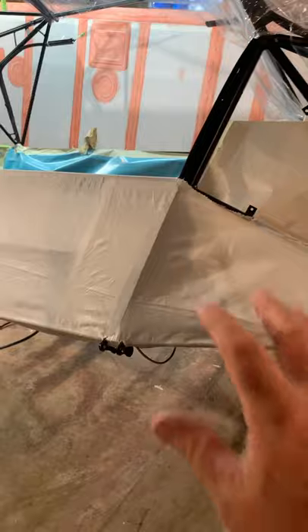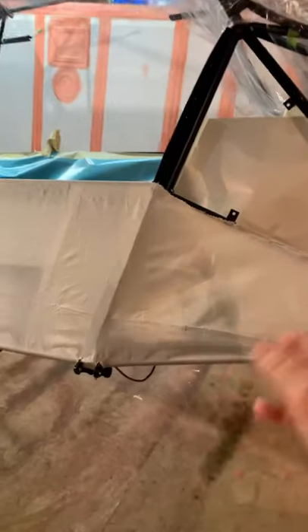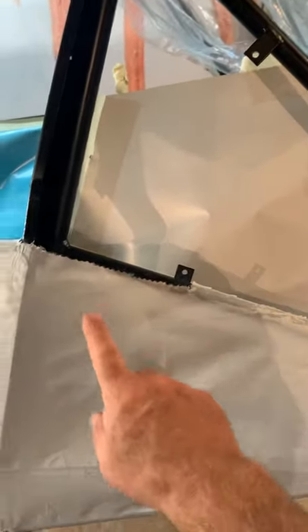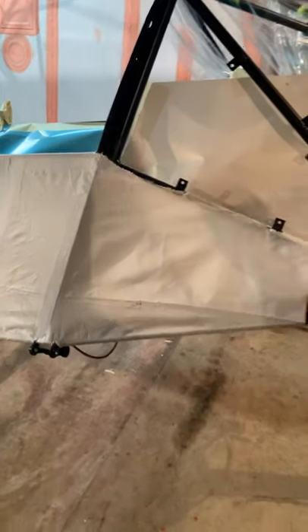A note: poly brush is also a type of glue. After you poly brush — putting the tapes and everything on — it goes down and grabs the poly tack, grabbing hold of all these metal areas it touches. So this is a temporary area. After the airplane is completely poly brushed, poly tacked, and painted, I come back and cut this out because there's a battery hanging down here with ignition boxes and backup batteries. You'll end up cutting most of it out anyway — you can wrap it around the back of the fabric spacer or just leave it. I tend to go with how Cub Crafters usually does it.